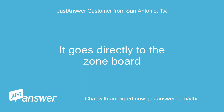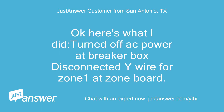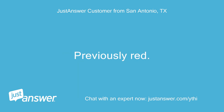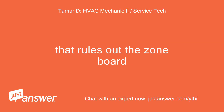It goes directly to the zone board. Can you try to remove the Y-wire from the zone board and see if the error happens again? Do I need to cut power first? Here's what I did: turned off AC power at breaker box, disconnected Y-wire for zone 1 at zone board. While power was off, zone 1 light was green — previously red. Turned AC power back on, restarted Nest. Same error occurs with Y-wire disconnected at board but not thermostat. So with Y disconnected at the board, the error still happens — that rules out the zone board.